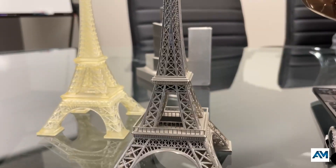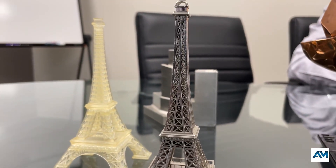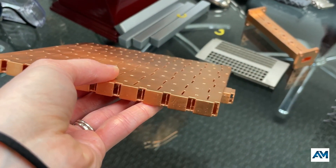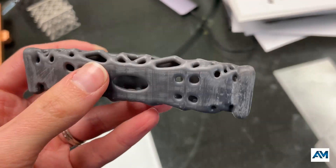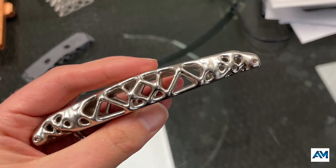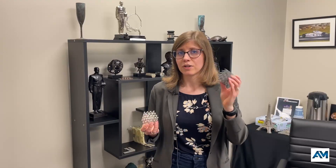There are a lot of different reasons that you might want to electroplate your 3D printed parts, including aesthetics, but also things like EMI shielding, electrical conductivity, heat conduction, as well as mechanical properties. You can improve the strength of the polymer part through this process, giving you an option in between 3D printing with straight polymer and going all the way to direct metal 3D printing.